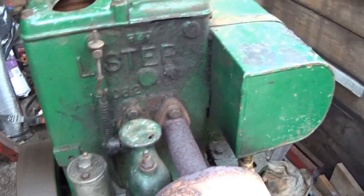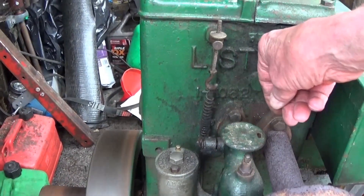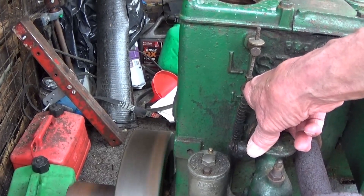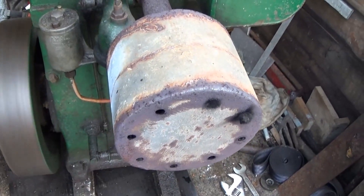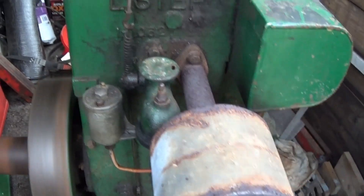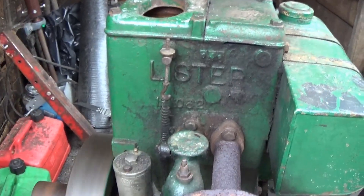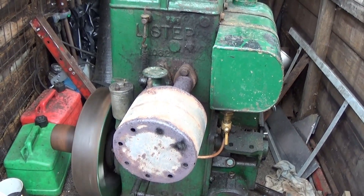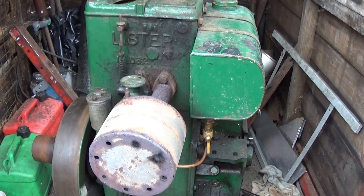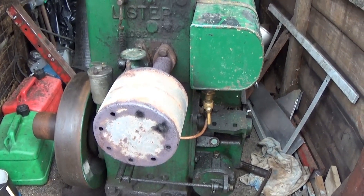Now I've got to load it up for you a bit, just to let you hear it. I'll put it in gear and hold the mixture on. Drop it in — and it runs alright. That's about right. It might need to be backed off a little, but it's still running alright. I think you'll agree — on this engine I've set the timing about right. I did it by moving that little sprocket at the bottom back and forward. If you go to my very first video of it, you'll see how it ran when I got it. Right — long enough for today. Hope you found it a little bit interesting. We'll try and find you something else soon.